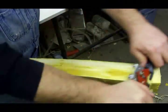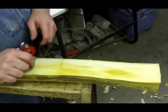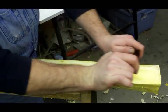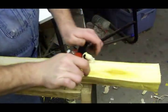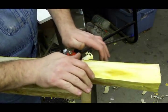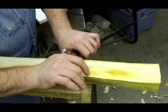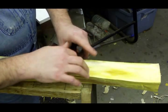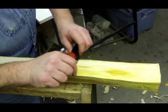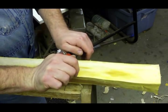You don't need to fight it. Don't fight the knife; don't try to push down on it real hard, just push it forward. Notice I'm not even putting any pressure down — just enough to hold it. It will find its flat spot there on the stave. Just keep pressure against the stave with it and keep it going forward. It's got a rhythm and you've got to feel that rhythm.